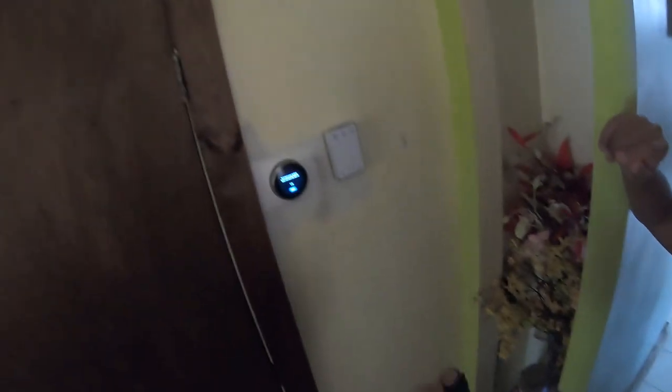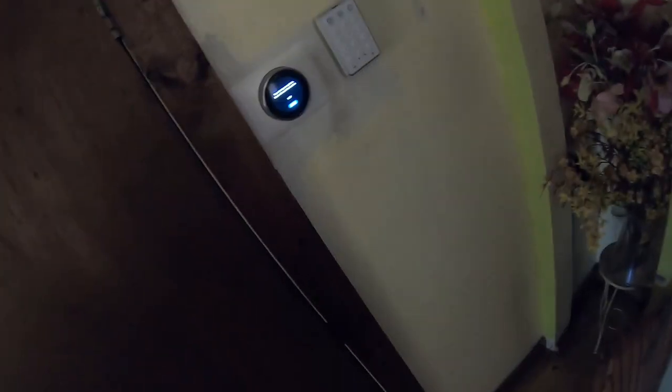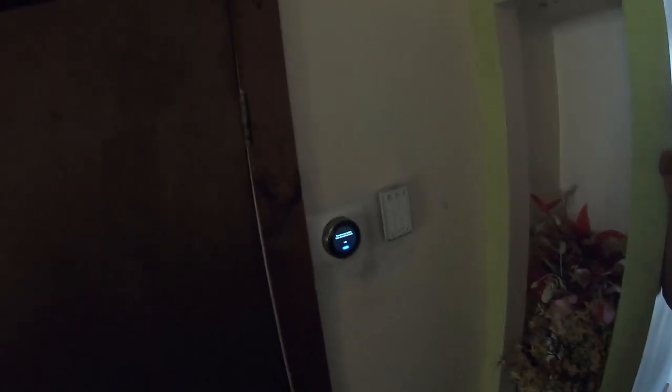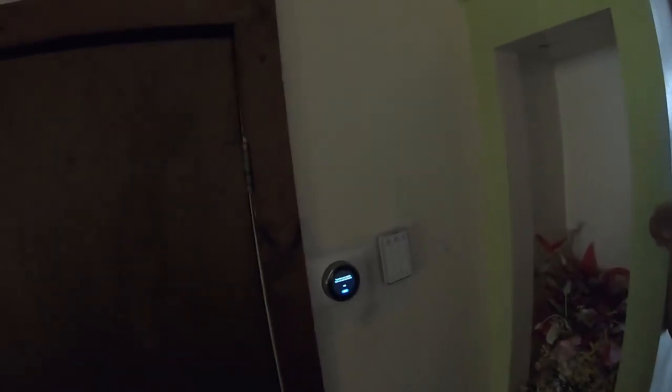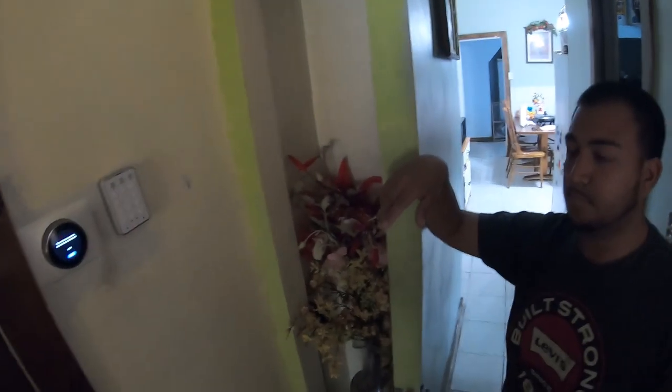I want to see that outside unit. Worst case, this is what's going to happen. Worst case, it doesn't turn on. I'm going to take it out and jump it from here. That way I can check the integrity of the wires from here down. If the outside turns on, it's this, 100%. And then you could either get a temporary one for now or get another one. Or a hard reset. Maybe a hard reset, because right now it's not completing the circuit from R to Y.